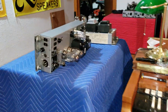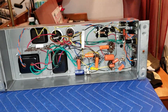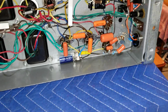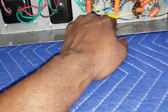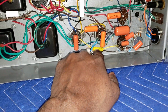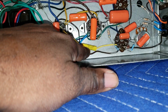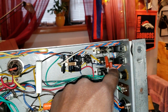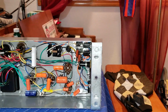Okay, sounded something like something was getting interesting there with boxing. Okay, here we go. Back to this amplifier, this beautiful amp. New caps, new orange drops there. Of course, new cathode bypass capacitor. Tried something new here for this coupling capacitor. Tried a different brand. Coupling capacitor there, and some different suppression caps there, and I like them.